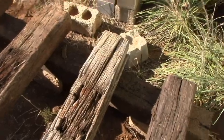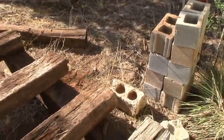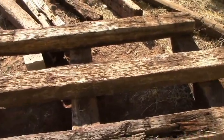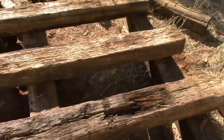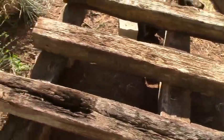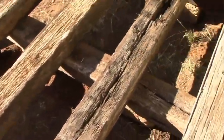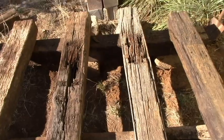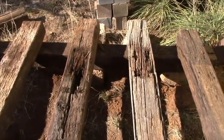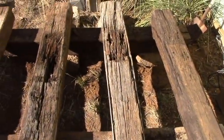If I put some plywood on top, shoot a couple of screws into it, that'll just kind of hold it together real good. I'll probably put the screws only around the outside edges where it's not under the tank, and I'll do that after I get the tank on. To start with, I can put a couple just in the corners and along the very edges where I feel pretty good that the tank won't be. And that probably would never be a problem, but all it would take is a screw to work out somehow and start digging into the bottom of the tank and be a problem. I don't think it would, but nonetheless, we may not do that.